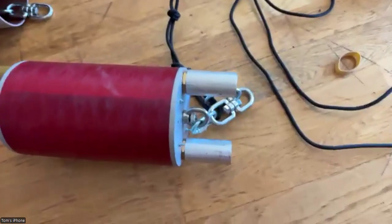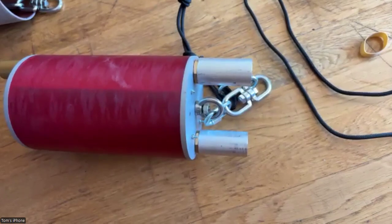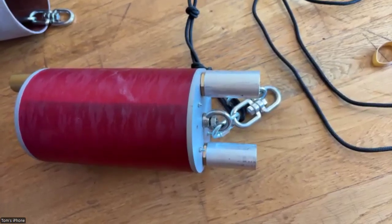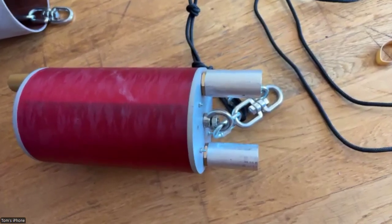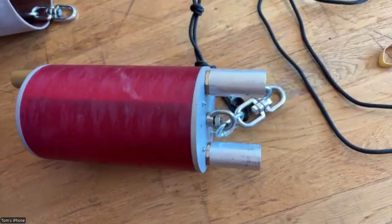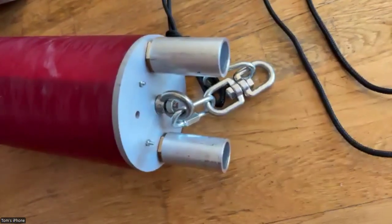60mm line. So we've got a document from Jim Jarvis we found online, as well as a couple of other sources, saying black powder deployment might be less effective at higher altitudes, so we wanted to maximise the volume of the charge wells, basically to ensure complete combustion and proper pressurization of the drogue parachute bay. Okay. And so then you've got something to seal the tops of those charge wells, at least to hold the pressure in there long enough for the black powder to fully combust and then pressurize the bay. Yeah, absolutely.